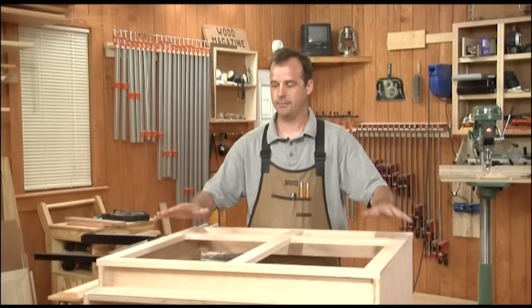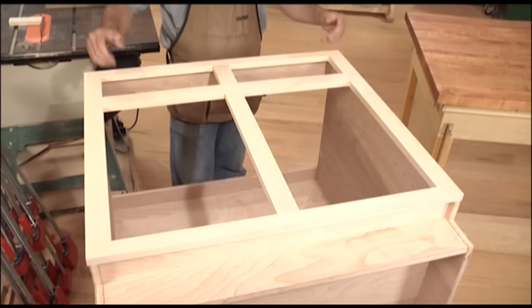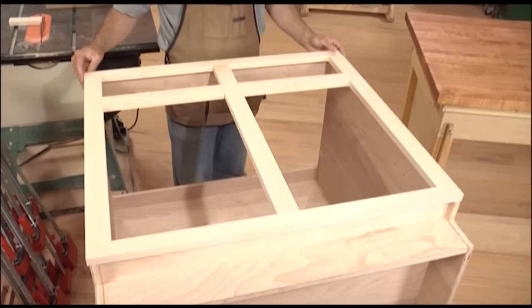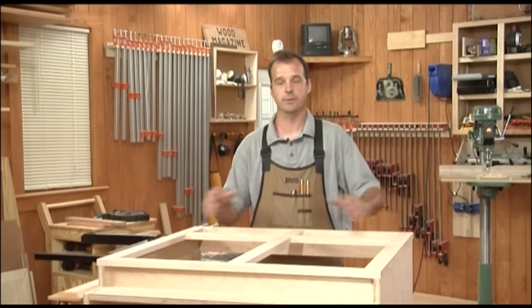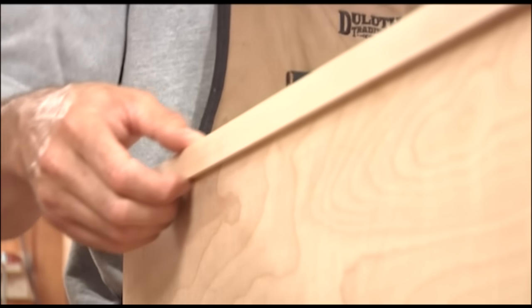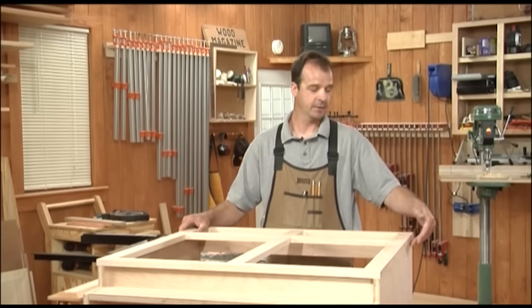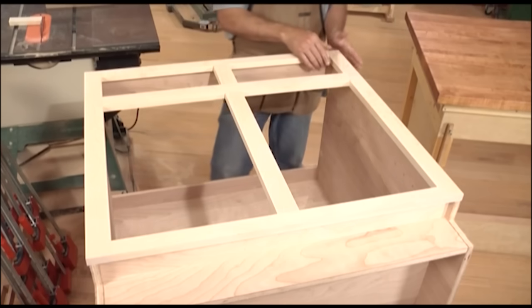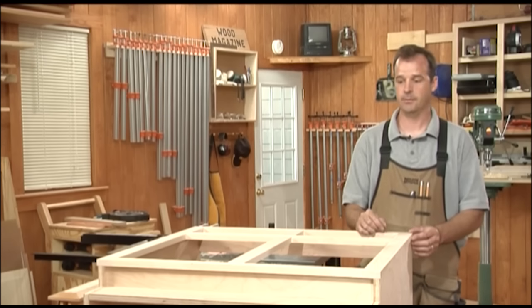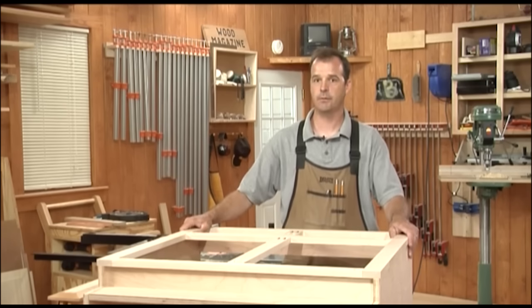In this section we're going to talk about the face frame and how to build it. I like to build a face frame that's slightly larger than the box — this gives a little fudge room in case dimensions don't work out exactly, since three-quarter inch plywood isn't really three-quarters of an inch. I leave about a quarter inch of lip on each side. This also helps when joining cabinets together. Pocket screws are used at all joints, just butt cuts.